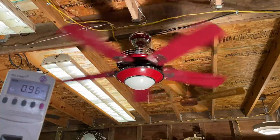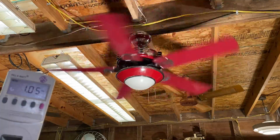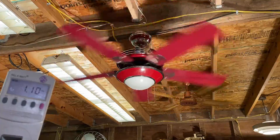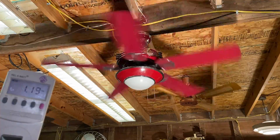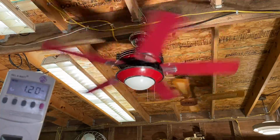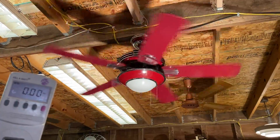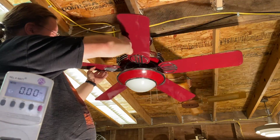Here's 25. I know I've got a ways to go. Twenty-eight, thirty, thirty-one, thirty-five... am I close? Thirty-eight. I'm just going to max it out at 40 microfarads — I know I'm still under. I'll hit the high switch. Yep, definitely still under, so higher value controllers are safe. A 4-7-11 is a little too underpowered for low speed.